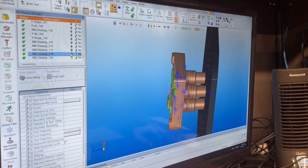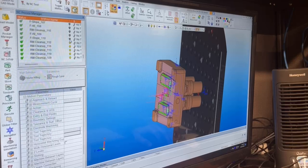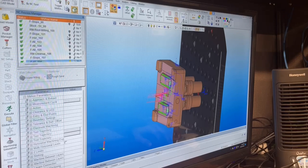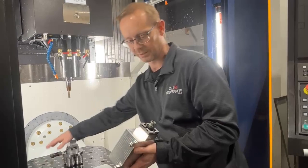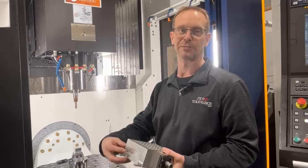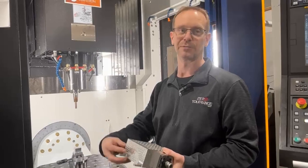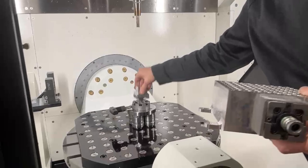These will be locked on, then I can flip it 90 degrees, make the cuts, and we'll end up with a huge time savings for these hard blocks. This is not a wild, crazy 5-axis maneuver — it is a very straightforward, economical, practical way to save time and money using a 5-axis machine for this type of work. Part of the reason for moving toward this fixture setup is that if something has to be changed or tweaked, normally without fixtures that becomes very complicated — you've got to make a whole new setup and find your reference again. If you have it set up like this from the get-go, it's easy.